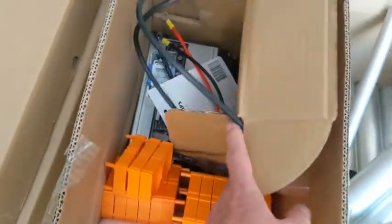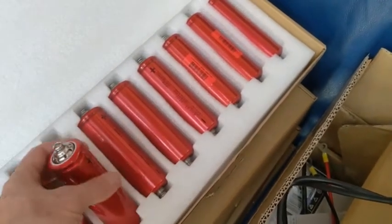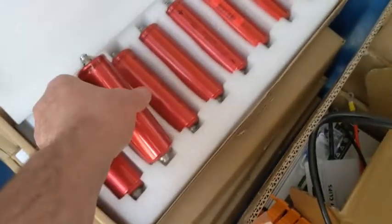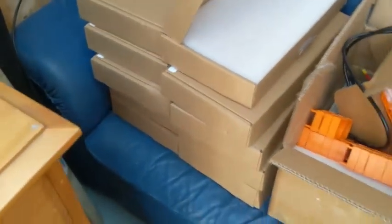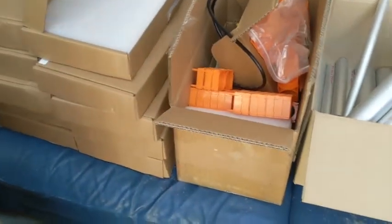This is the battery pack — batteries go in these little holders, and there's the battery charger. This time I'm using these: they're 3.2 volts each and they are high-power batteries. The original ones I used in the first bike were rated at 10C, so I thought they'd be better, but it turns out they couldn't provide the power I really needed. This one should actually take off properly — on the other one you couldn't take off at a super fast speed without risking catching a battery on fire.